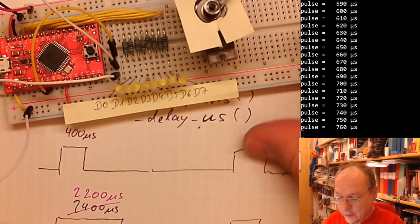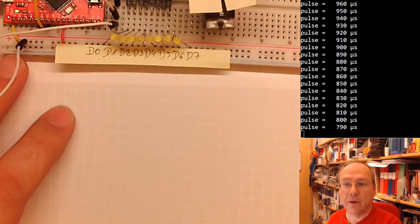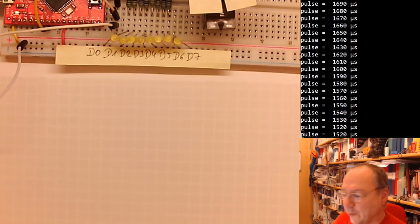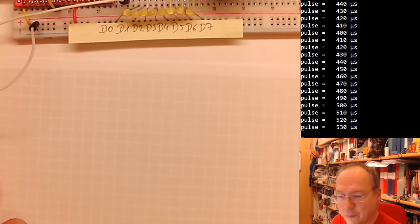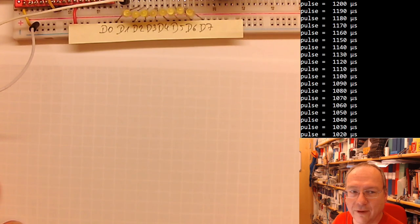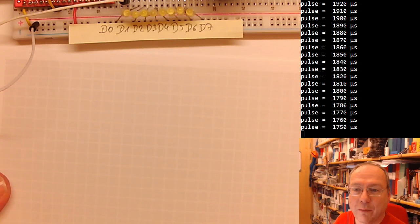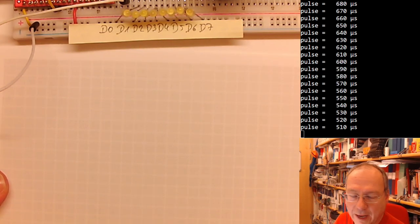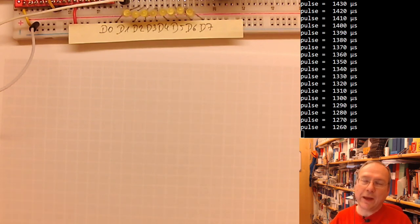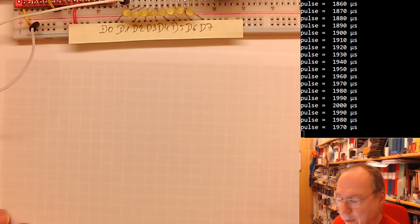Yes, this code is 100% blocking, for those of you more familiar with computer science terms. I think I used blocking in the description I wrote in the lab instructions. We call it blocking if the CPU isn't able to do anything else. We could, of course, do things inside the loop, but we must always take care to be back for the next pulse and not to be busy with other things during the pulse.